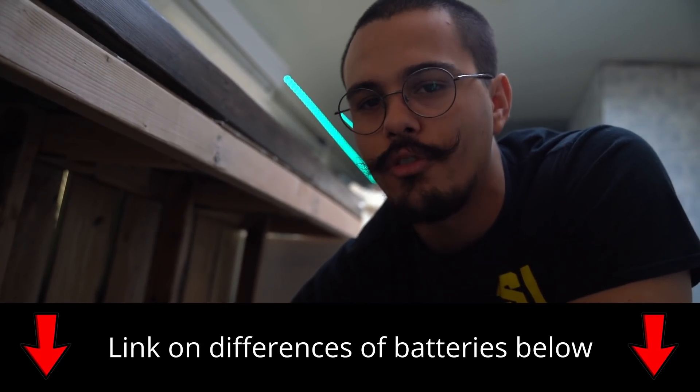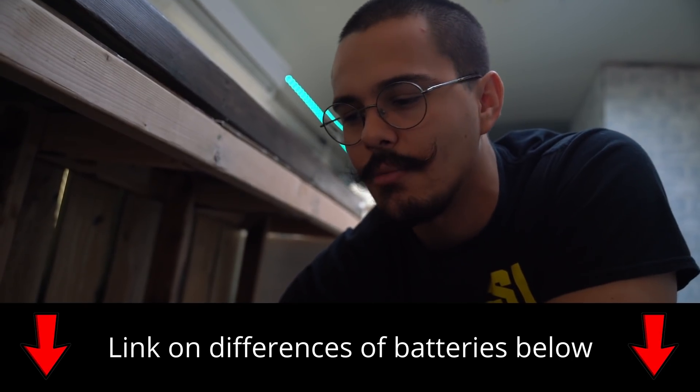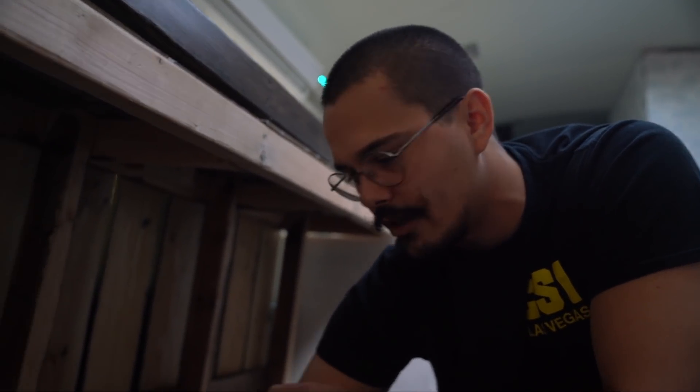The next big thing about batteries is that you need to know the type of battery, because some are sealed and some are not, which means some actually off-gas and some don't. I have a sealed gel battery here, which means it doesn't off-gas. They're deep cycle, meaning they're able to expel 40%, 50%, or 60% of the power without actually damaging the battery. Most people doing conversions go for deep cycle batteries, and we decided to go with gel batteries.